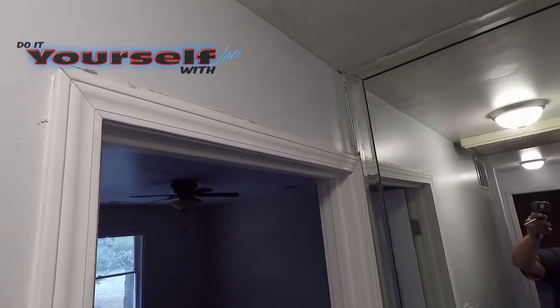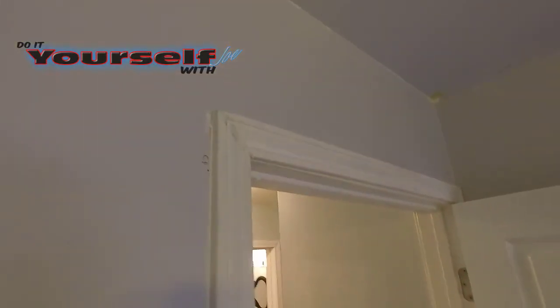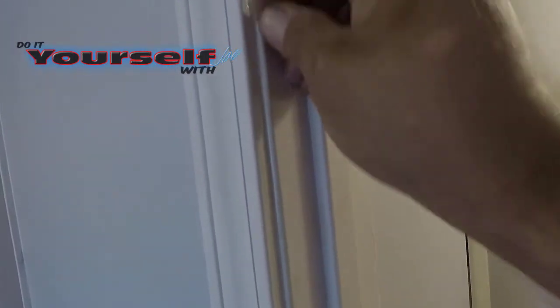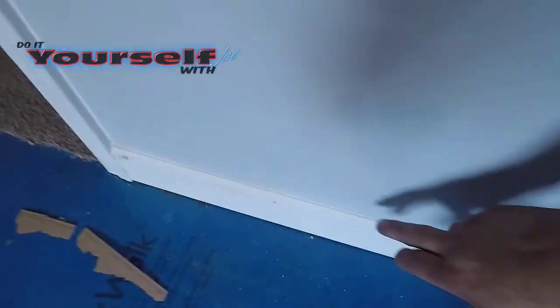When you get to the end, let me know what you think the problem is. If you watched my last video, you'll probably notice that I removed all of the trim — all the base, all the window casing, door casing. If you're just going to patch and paint, you shouldn't have to do this. But if you look at some of the footage here, you'll notice the caulk is very shiny. What the previous homeowner did, or had somebody do, was caulk everything with silicone caulk.